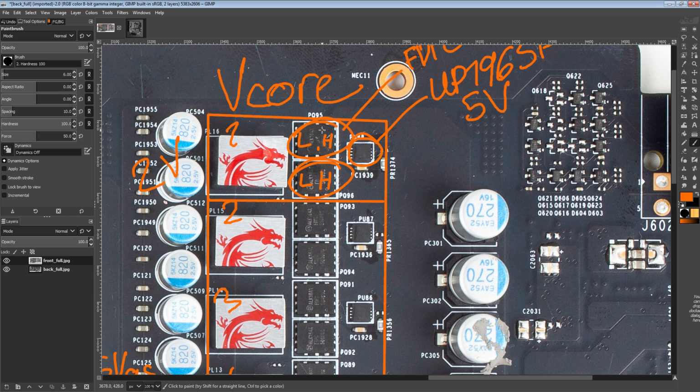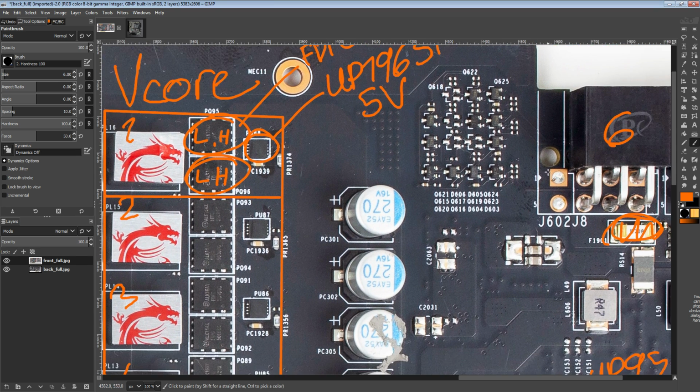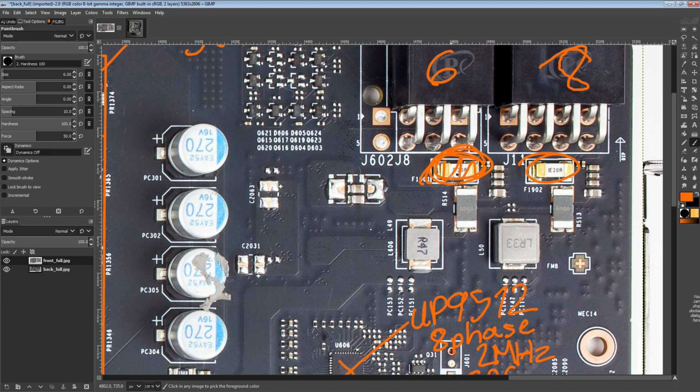So every time you try to power cycle a card where the VRM has failed, you're basically causing more and more damage, because if that initial failure didn't kill the core, every time you power cycle it, you're getting one step closer to killing it for good. So, in that kind of a scenario, the fuse can actually be helpful.